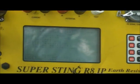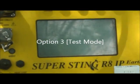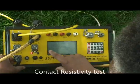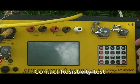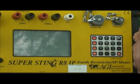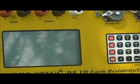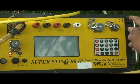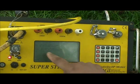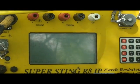So the next option we use is number 3, test mode. If you press test mode number 3, in the submenu, the first one is called contact test, and you press option 1 to make a test. So basically, in this test, the system is going to send current to the ground, and it's going to measure the potential difference, the voltage, between electrode number 1 and 2. If there's conductivity, you're going to see the reading in the instrument. If no reading, you're going to see that a code error comes up, and that means something is wrong.